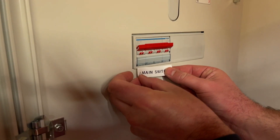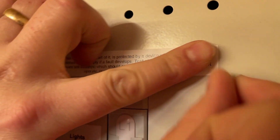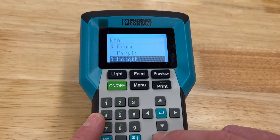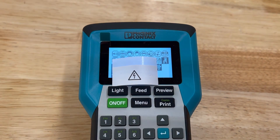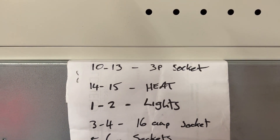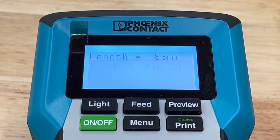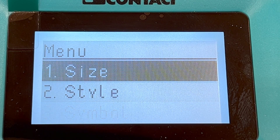With distribution boards like this, you can design all the essential labels you need — from main switch to RCD testing labels — and store them inside the memory so they're ready to go when you need them. You can also set a fixed length of label so that all labels look the same regardless of the text length for each individual circuit. There are plenty of symbols in there that will cope with most electrical needs, and the manual cut option means it doesn't spew out loads of excess material between labels, so you won't waste any consumables. We like the little preview feature on the screen so you can see what the label is going to look like, confirm you've imported the right symbol and the correct label length, and of course you can alter all the font sizes, types and orientation.